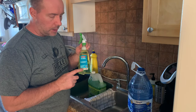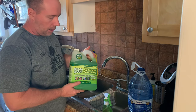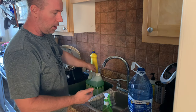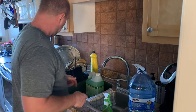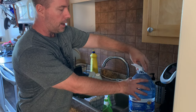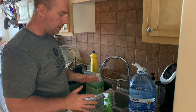I got a 22-ounce container. I took two ounces of Simple Green and just filled the bottle up, but it really calls for 20 ounces of distilled water to make the solution. I watched this from Bar Tools — this is how he lubricates and cleans his diamond sharpening stones. But I'm going to go clean a regular sharpening stone now.